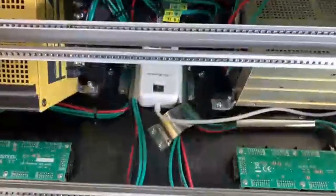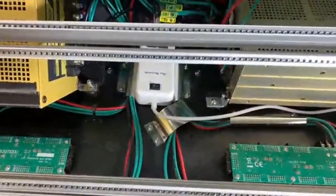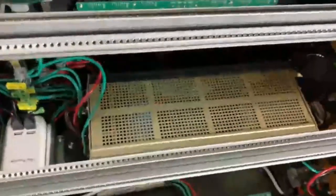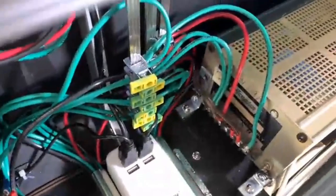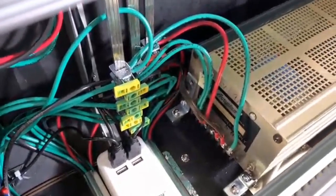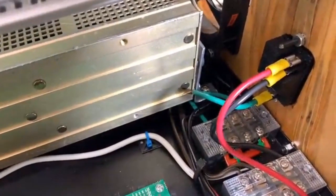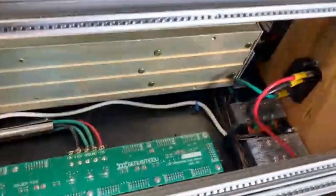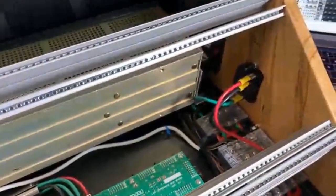Yeah, so sorry, Chris, can you just reiterate that last point about the tip for reducing noise in a system? Yeah, no problem. It's a design necessity that the power supplies that we use have their input ground on the AC side separated from their output ground on the DC side. And you need to do that so you can wire one backwards to be your -12 volts, things like that. But at the end of the day, all these green wires are the ground bus in my system. The DC ground eventually needs to get reconnected to the ground on your AC, on your mains, that center prong on your plug. It's safer, but also in this system, in its original configuration, it had a little bit of noise until I ran a ground strap just from my module mounting rails to the mounting rails for my mixer, and it killed off the last bit of noise in the system in its original configuration.